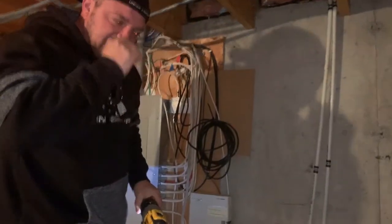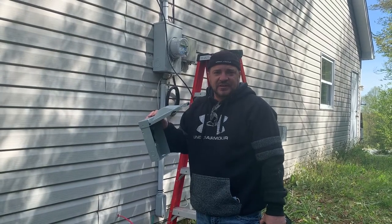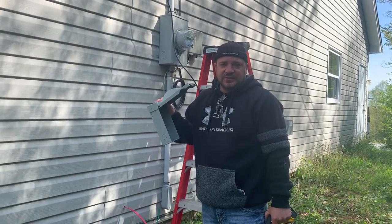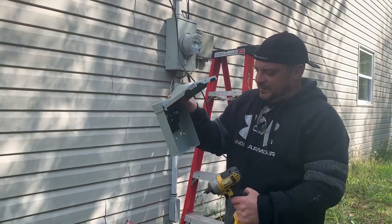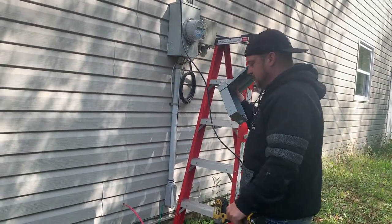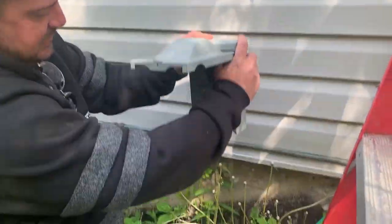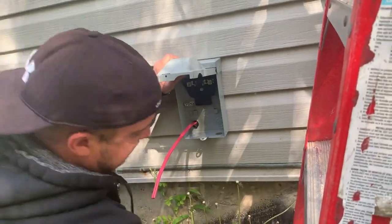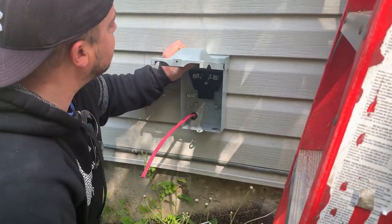Now that we've got a hole through, we'll go outside and get the wire geared up and stick the disconnect on. We're going to install a disconnect on the outside which has a breaker that turns off and on to go to the unit. These are outdoor-rated disconnects that we use — they have a breaker that goes right in them and we come out the bottom with our whip. In the back we put a grommet so we can go onto the wire on the side of the house. We'll screw that on first, and this gets screwed right to the house.